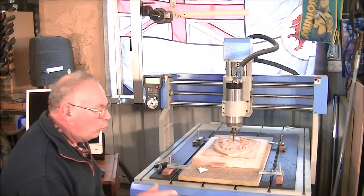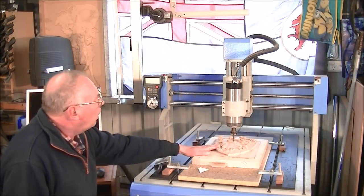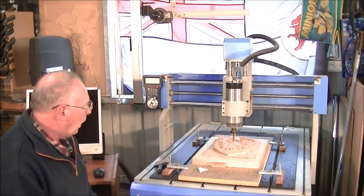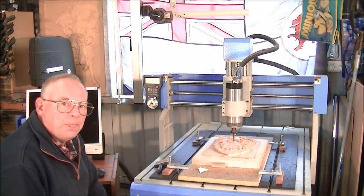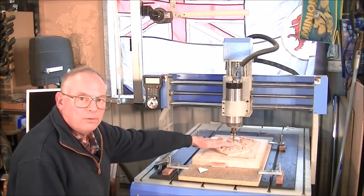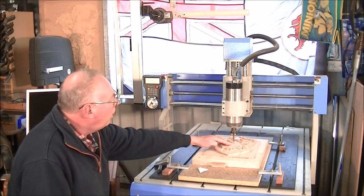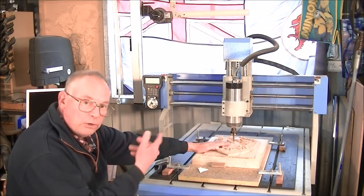Answer to question number two, most asked. Now, I completed the roughing with the 6mm two flute ball mill, and the machine has come to the 0-0 position, which is in the center of our piece of work. And last night I switched the computer off and the machine off in that position. And the question I'm going to answer is, because now I've machined this material away, how do I change the tool and find the zero point of the material again? Because it's 19 mil above this. Well, it's very easily done, actually. And I will take you through the procedure.